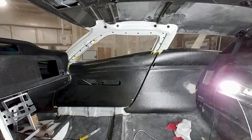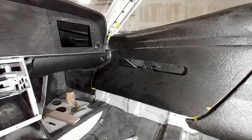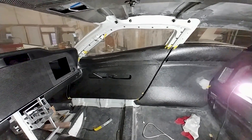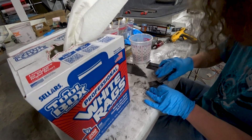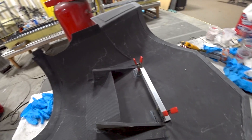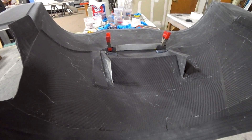You can see that large hole in there — that's where the bearing will be pressed into place. Back in the cabin, this is what it looks like with the three panels in place. The door panel fits there nicely — still don't have the armrest on, but that's looking nice. You can see how the panels all sort of fit together, and we'll have carpet on the floor. Meanwhile Jeff and Devin are working on hinging the little outlet door to let the hot air out of the bottom of the cowling. Devin's roughing up the hinges — they were using some of the remaining carbon fiber hinges bought for the gear doors. Here's the little layup bonded in with all those hinges bonded onto the door, using a bit of straight aluminum to make sure the hinges are perfectly in line.